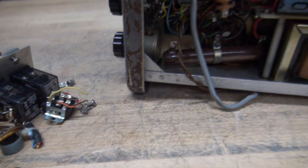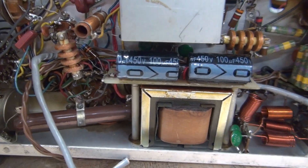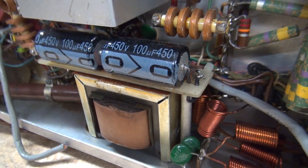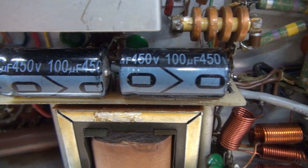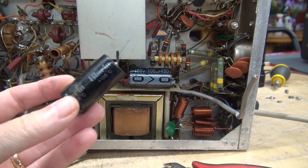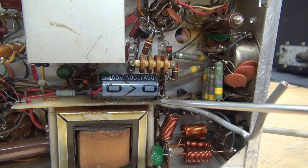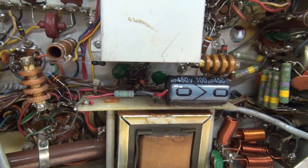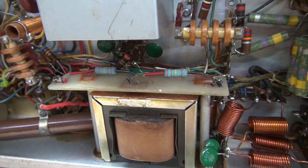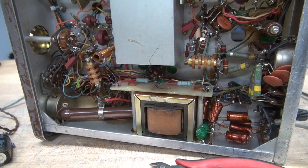There's the pile topside. Next task is to get this cabling out from under the chassis. Unfortunately, the previous owner put about 10,000 zip ties behind the filter caps, so I'm going to have to take out the filter cap assembly to gain access and then take a look at the value of those caps. Since I'm going to remove this filter cap assembly, I went ahead and popped off one of the caps. They're actually epoxied to the board, so I'm going to have to pry those up and then I'll be able to access the wiring behind. I removed those filter caps, gained access to get that harness out. I will be replacing those filter capacitors.